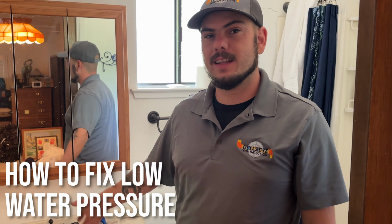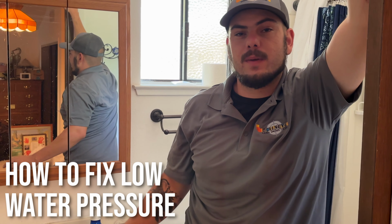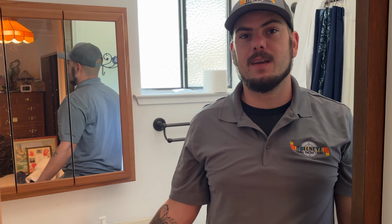If your pressure is low in the sink, it may be due to an aerator. Repair can knock debris loose, so that's why we clean the aerators at the end of a job. If we weren't able to flush all of it out of the aerator, all it would take is another simple cleaning. And this is how you clean your aerator.